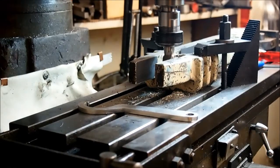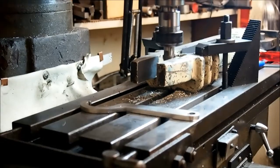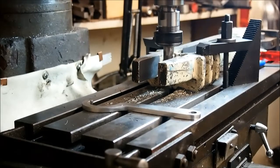I'm going to make a cut — taking one tenth here, which is three thousandths. The bronze is machining very nicely. It was pretty difficult to machine on the other mill and also very difficult to saw cut, so I'm pleased that it's machining with this cut quite nicely.